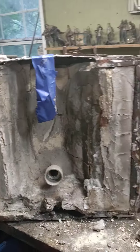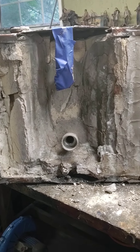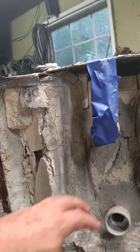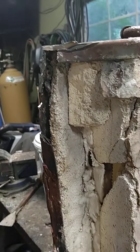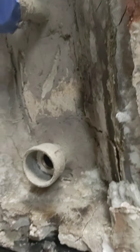Well, I opened up a can of worms this afternoon, and it's going to be a while to fix it. Yes, people, that is the top of the forge. Tried getting the jets out, and I couldn't get the old ones out, so I had to cut the welds on the corners and pull the top off. And as you can see, it's got a lot of damage up inside there.